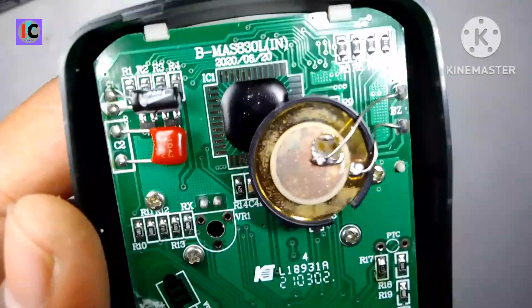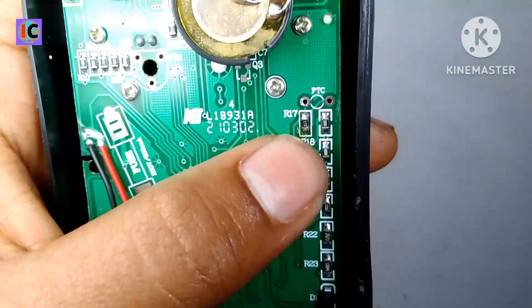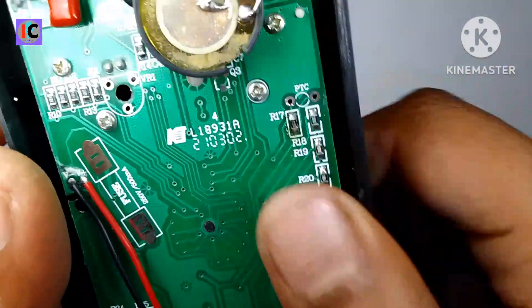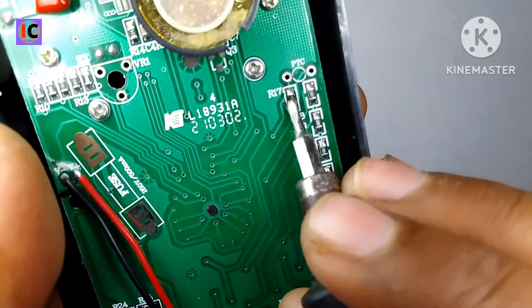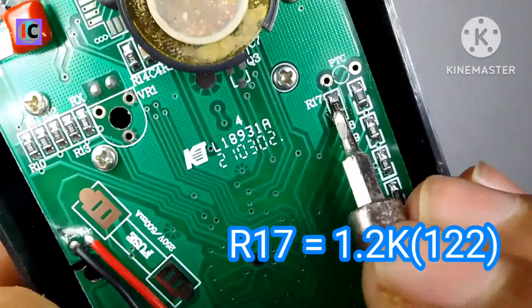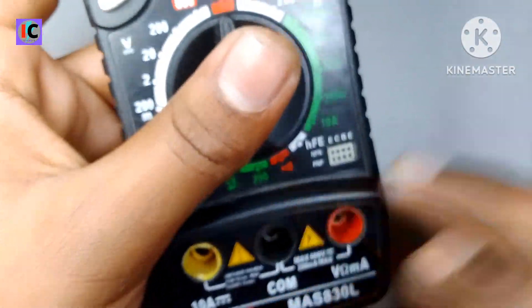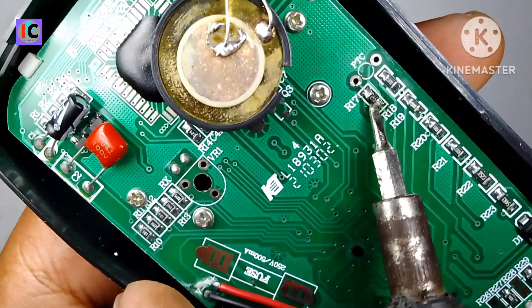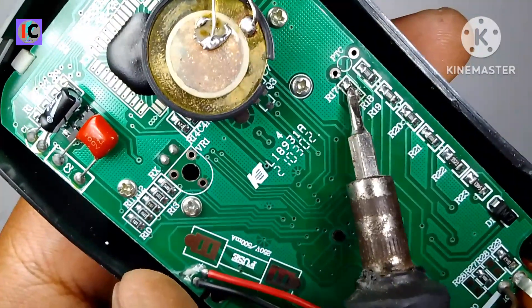But when I move around a little bit here, it's R17 resistor — it's partially cracked. Here is the crack on the resistor and it's written code 122, so this is the main reason for our continuity portion problem. It's a 1.2 kilo ohm resistor.